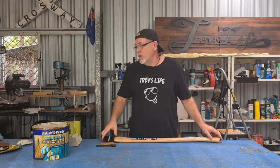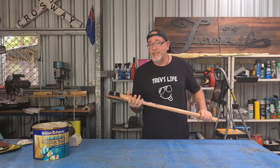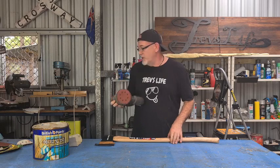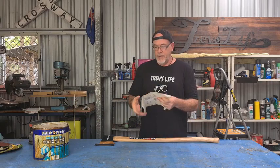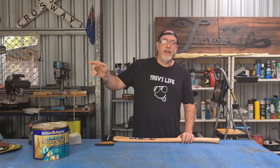For sanding, I'm going to knock off this varnish — and another reason we're getting rid of the varnish is because if you use this for a while it'll give you blisters, it's not good. With an oil finish you won't get as many blisters, hopefully. So I'm going to use this little palm sander, run a 120 grit sandpaper just to knock that varnish off, peel the stickers off, then come through after and hand sand it with a 400 grit to get a beautiful smooth finish.